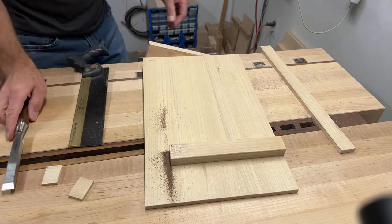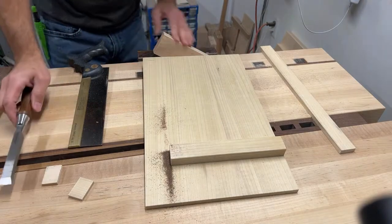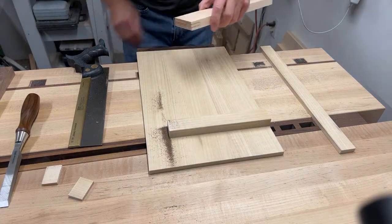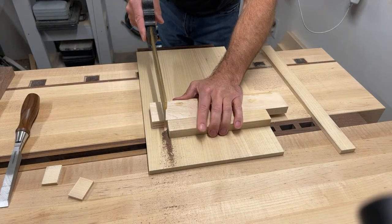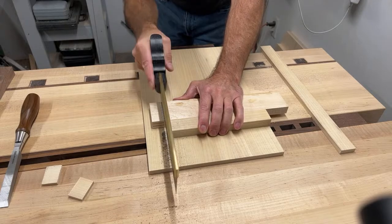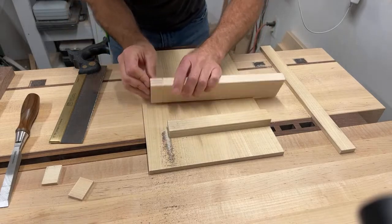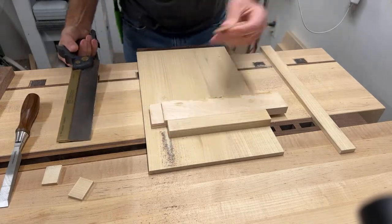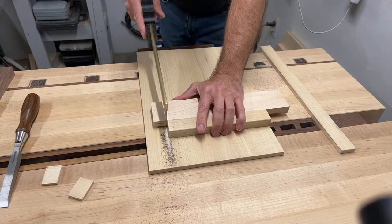I think I'll go back off camera and just fix up the other sides of these where I'm doing the knife wall on the thickness part of the piece of scrap I've got. Now, I'm not too optimistic I'm going to be able to control this crosscut saw across this maple, but we will find out here. I'm just going to work from the one side to the other side and then kind of shoot all the way down the shoulder. Probably would have helped if I had got the depth of that tenon set perfectly, but I did not.